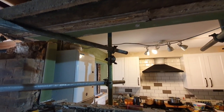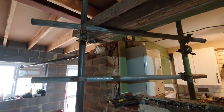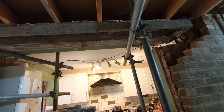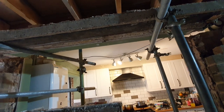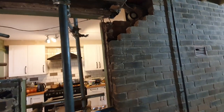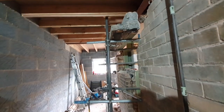This one's a bit different because there's some tape on the scaffold tube. I'm going to do this side and then ultimately we come down inch by inch all the way to the ground, where we can then either pop it on rollers and roll it out of the building, or we can just smash it up where it is with a sledgehammer and cut through the rebar with a grinder. We'll see. But it's quite sketchy and I can't really get a genie hoist in here.